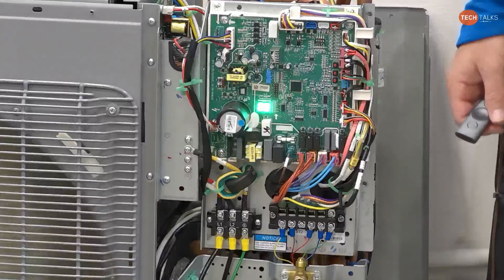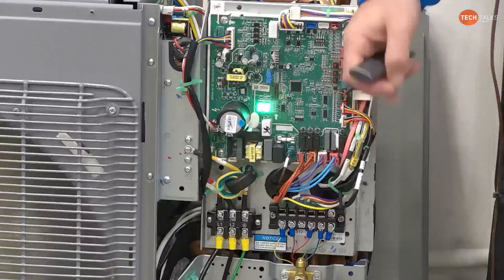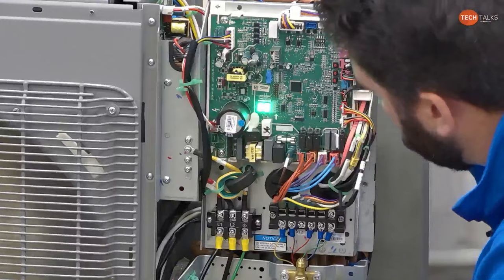Yes. It's not on the drive boards. Or the filter boards. Yeah, but this one's replaceable. Same on the indoor board. And that's something else to mention. I didn't bring it up when we were talking about the air handler, but I'll bring it up now. So there is a fuse on the indoor air handler board, but that is a line voltage fuse.